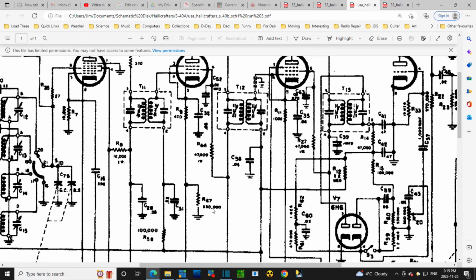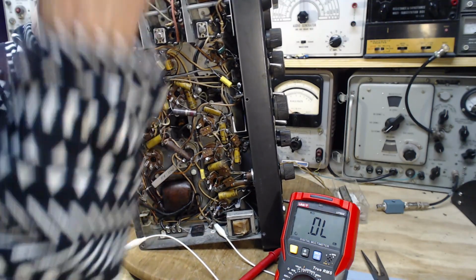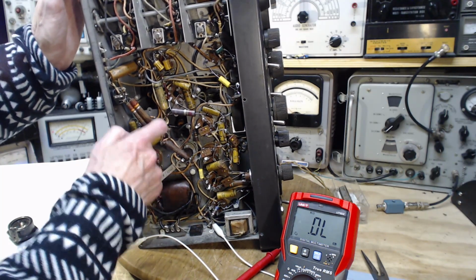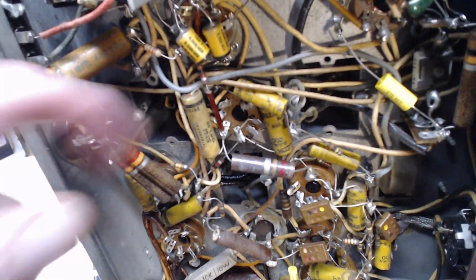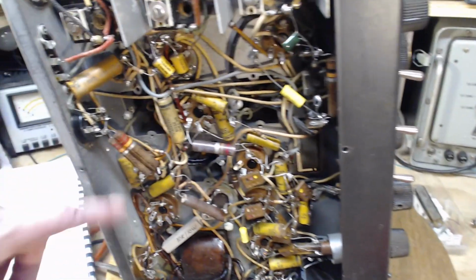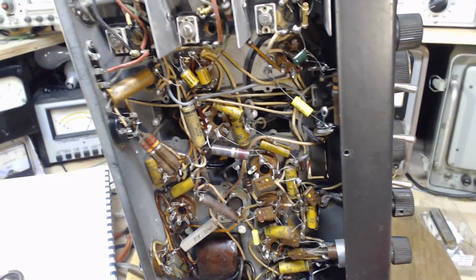Okay, let's see if we can find this guy then. A big resistor hooked up to this thing which looks like 1,000. Okay, so where are we again? Totally lost here. We're here. And we're thinking this resistor is the one in question. It's a 1,000. Brown, black, red. Over here is a 33. Well, I have to guess 30. I don't know. Look at that. So it's got two nice orange bands, and then the last one, wow, it looks brown. Camera's not doing so good on it. And it's going to pin over here. I don't know what to make of that. This is just not matching well at all.